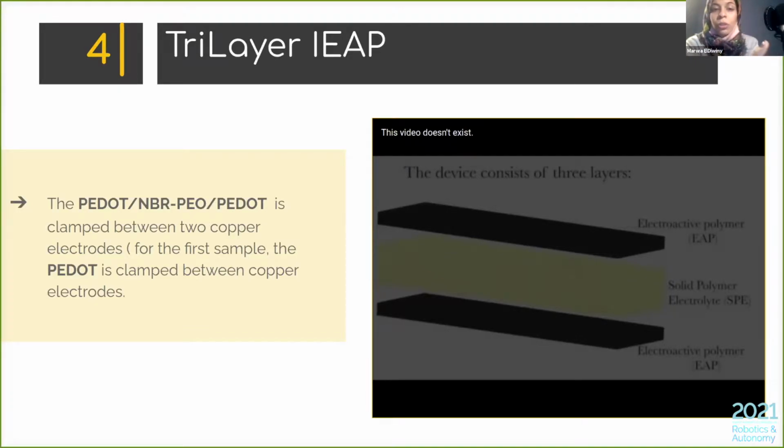The operation is called osmosis, where the ions are stored in the dielectric layer, which is in yellow. The ions are stored in this layer in between. And once we make sure of the concentration of these ions, in the lab you can even control the positive and negative, the cation and anion, and how the size of the ion should look. Why? Because, as the name ionic conductive polymer suggests, the size of the ions contributes significantly to the amount of force produced. So imagine you make sure these ions fill the yellow layer completely and the concentration is consistent.